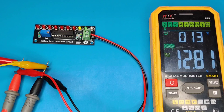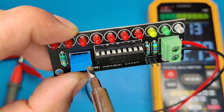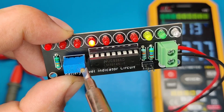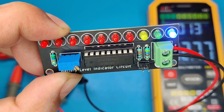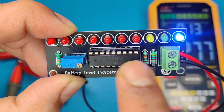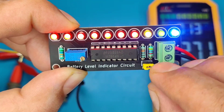Let's set the voltage accordingly. Grab the circuit and adjust the potentiometer clockwise until the blue LED turns on. Currently the circuit is in dot mode — you can short this connector to enter graph mode.